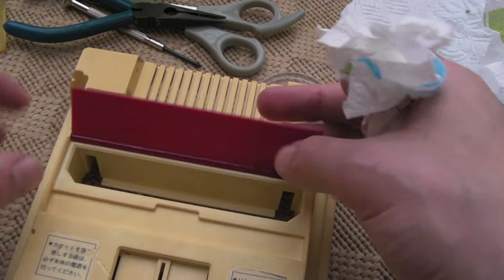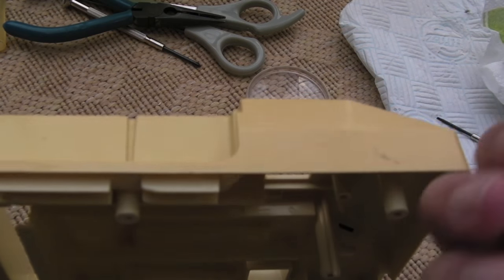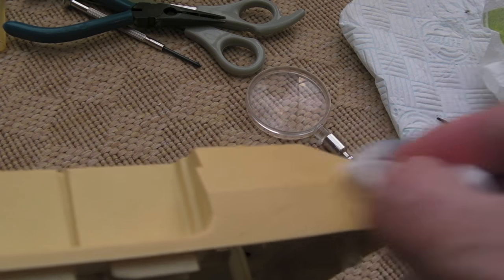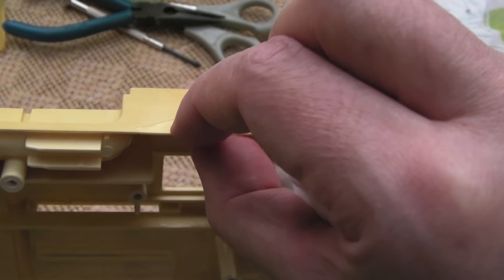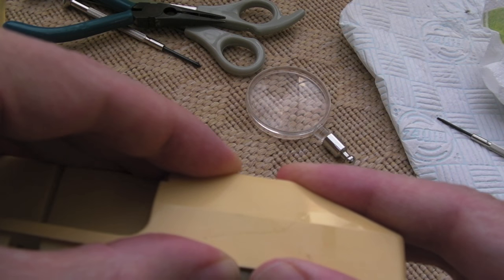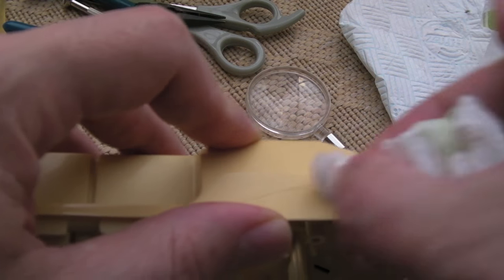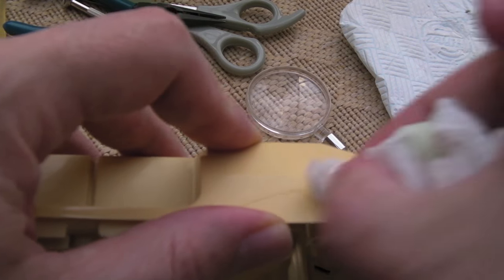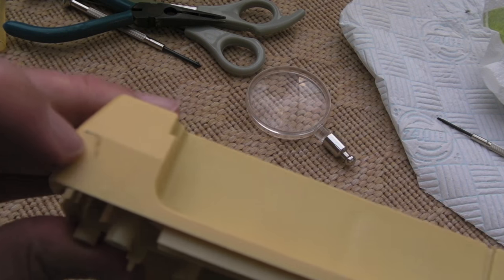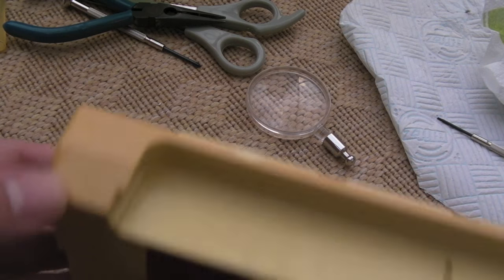I'll probably stick a socket there, which will allow me to use this as a test board to test SRAM chips. So I've connected up here. There's value in just showing you what happens when you've got no SRAM — you just get a grey screen. So if you ever get a NES or Famicom that gives you a grey screen, your SRAM — particularly the program SRAM — is most likely the cause. On the NES, the first thing to check before that is the cartridge slot, because it's always the cart slot on the PAL and US NES. But on the Famicom, you get a grey screen, it's going to be a RAM fault — nine times out of ten it's going to be an SRAM fault.